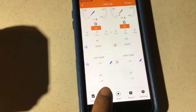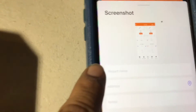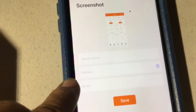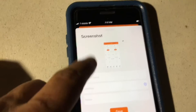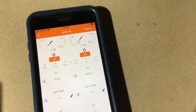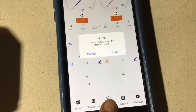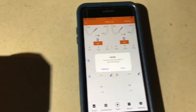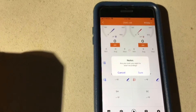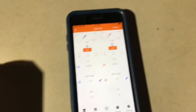It also has a graph. You can take a screenshot of what you're working on if you want to save a number. You can create your own report, name it, enter the address of where you're working, add notes, and save. It also has a recording function — it'll ask 'are you sure you want to start recording?' So if you're working on a refrigerator and monitoring pressures, you can set it to record and it'll save how the pressures are changing to your phone.